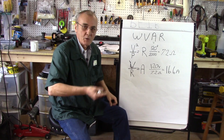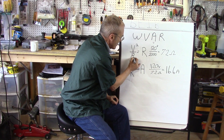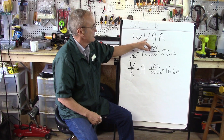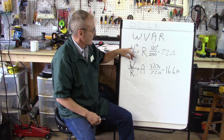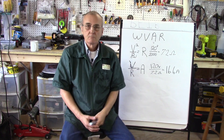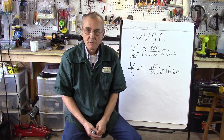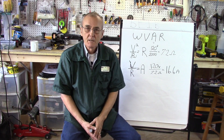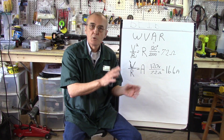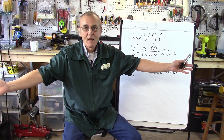Let me make a quick correction — voltage squared divided by W or P, the power wattage, gives you resistance. Now you know a 2,000 watt heater element on 120 volts pulls 16.6 amps, so on a 20 amp circuit you are safe. Stay tuned for the next video when we start talking about multiple elements in a system, because when you put multiple elements in the system it's a little bit different. As always, happy distilling.